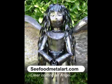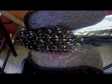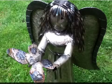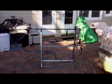Hello everyone, this is John Dunlop, aka Seafood Metal Art. In this video I'd like to show you how I accomplished the challenge of clear coating pieces such as these. When you look at the hair and the detail, how do you get the clear in there? So I basically created a rotisserie so that it will continuously turn until the clear has dried, not letting it run. And here you see the contraption that I created.